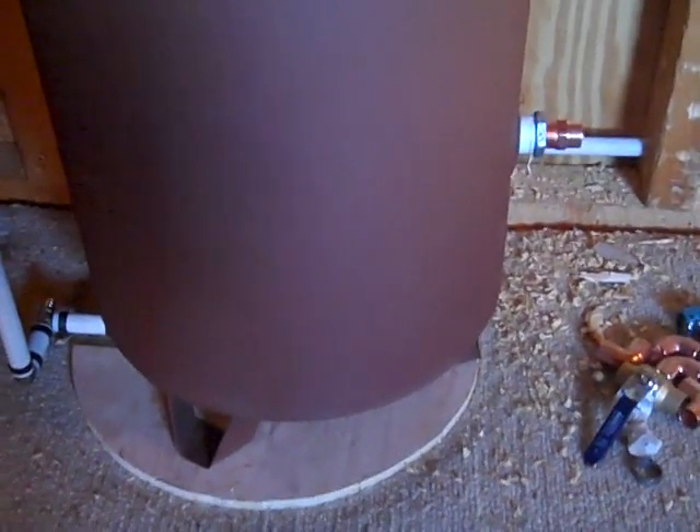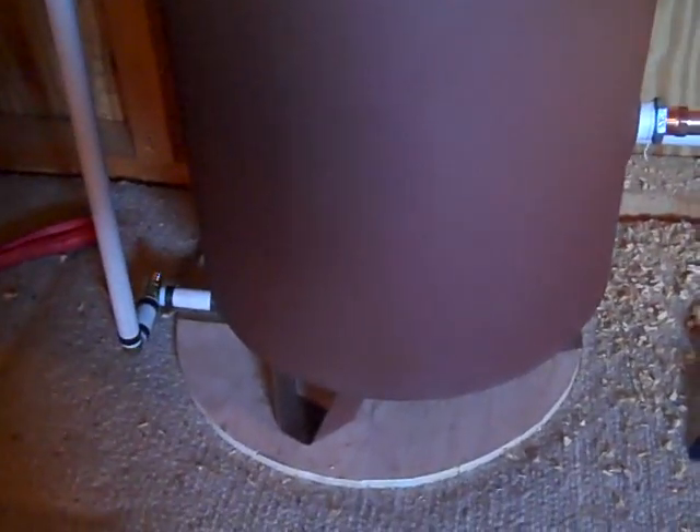The cool thing about this is even when the wood stove isn't running, this will serve as a tempering tank. Because we're up in a loft, this will be 40 gallons of very warm water in the summer — you could theoretically take a shower off of this tempering tank and it would be fine. I haven't tested it yet, but that's part two of making hot water the old-fashioned way. Thanks for watching.